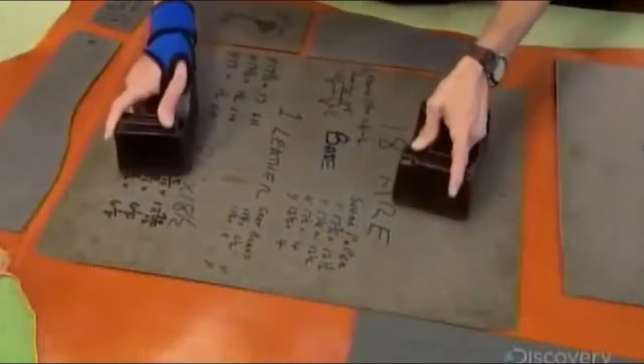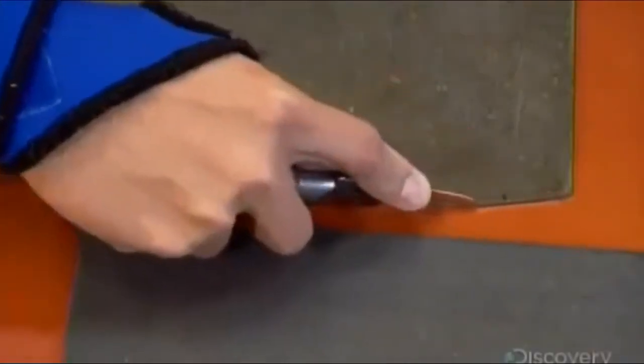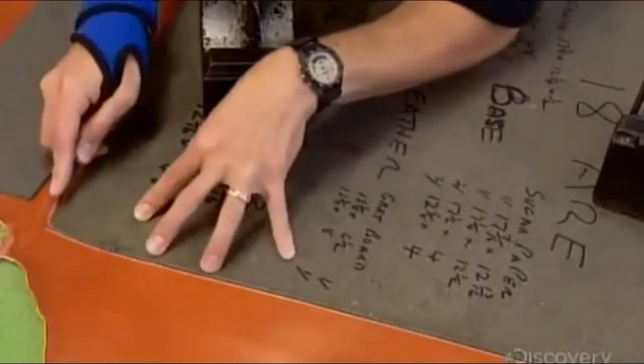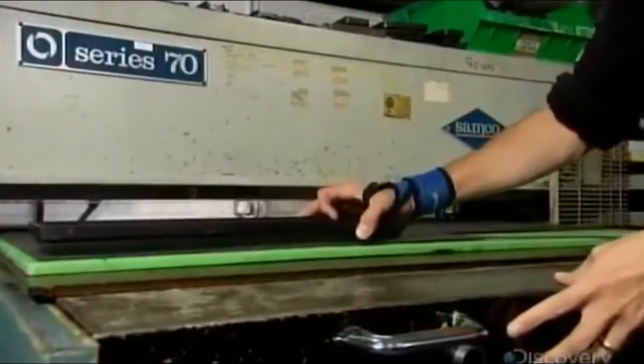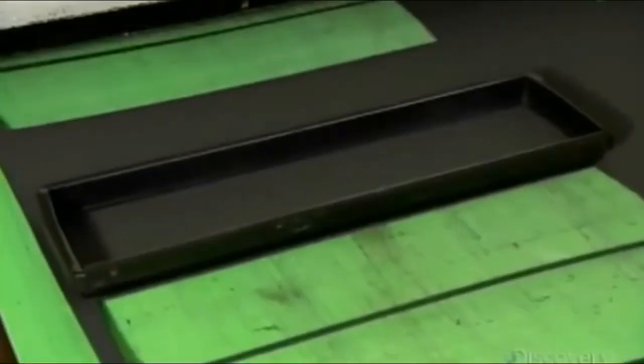The cutter lays out patterns for the various parts, then trims around them. Leather, being an animal hide, naturally has scars and blemishes here and there, so he's careful to select blemish-free areas for use as the main surfaces. Next, he uses a punch press to cut out what are called foundation boards, which will reinforce the leather. At this point, an expert leather craftsman takes over.